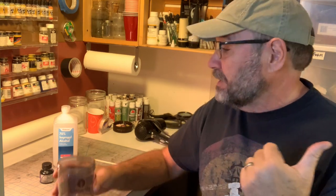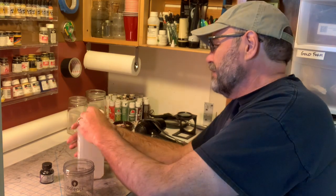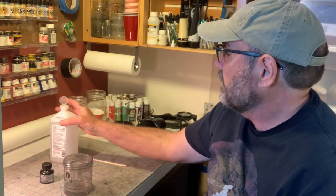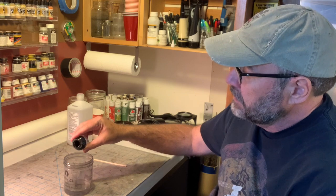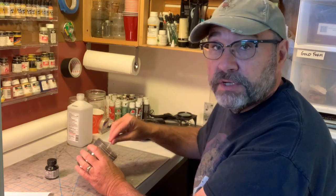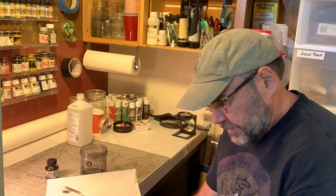When the ink breaks down you get a granular finish - it starts to dissolve the ink, and when you go to stain things you get more of a granular finish, which can be cool but it doesn't soak into the wood as well. So I like to make a fresh batch when starting a project. I eyeball the measurements - no scientific precision here. I take some rubbing alcohol first, about a quarter cup or less, then add a little bit of india ink.